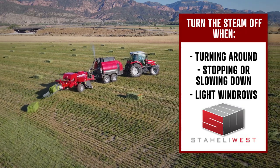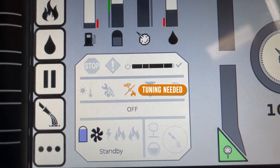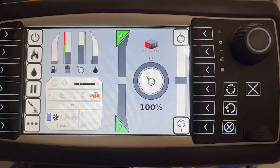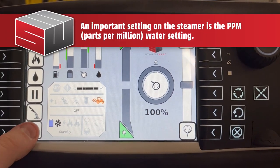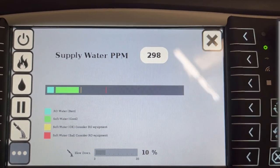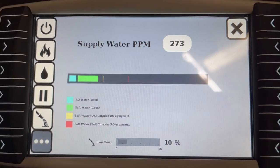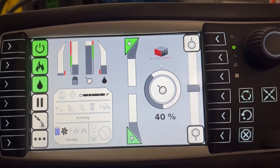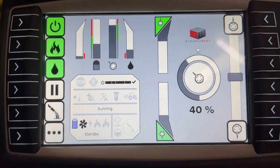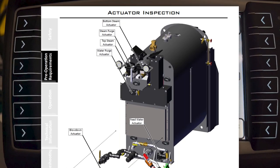Once a year, or any time the 'tuning needed' icon lights up, the burner should be tuned. Follow the instructions from test 1007 in the owner's manual to tune the burner. An important setting on the steamer is the PPM, or parts per million, water setting. Go to menu then water quality. The PPM setting should be based off of your current PPM of your supply water. The lower the PPM, the shorter a blowdown will last and the longer runtime you will have. The blowdown keeps the concentration of the water in the boiler at an appropriate level so that the water in the boiler will not become foamy and spill out into the baler. If you need to stop while the blowdown is still active, stop the blowdown to avoid creating dead spots by draining hot water in one place for an extended time.